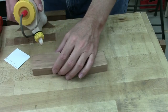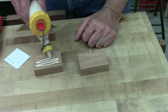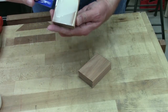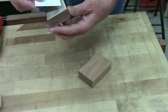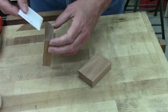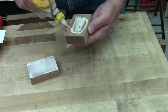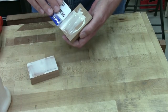There are two different ways you can do this. In this case I went ahead and glued my blocks together, then cut my mortises, then re-sawed the blocks and cut my wedge mortise. In the past I've made gauges where I put a reference edge and a reference end on both boards, marked out my mortise, mortised both pieces, cut the wedge mortise in one of them, and then glued them together. You have to have a really well-fitted beam that fits really tight in those mortises so you can use it to align the two pieces when you glue them together.